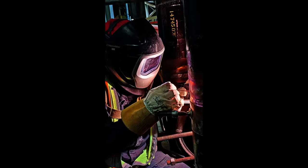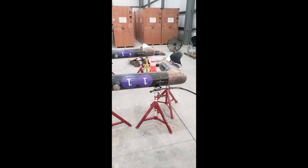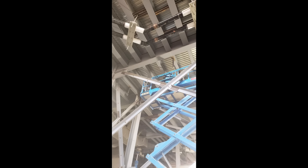Now, we didn't spend a lot of time talking about this copper welding. But Chris is one of 5 people in the country that are able to do this type of welding, and he trained the other four guys. There might be some other guys out there that have started offshoots, but he is the original one in the country that has been able to weld this copper. Each one of these 12-inch diameter, 1-inch thick copper pipes takes 8 hours to weld the one seam all the way around, on the floor and up in the air. So each one of these took 8 hours, a solid day. Some of them are on the floor, and others are 50, 60 foot up in the air, like where he's standing right up here on the platform.